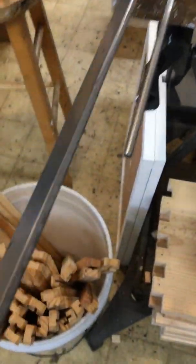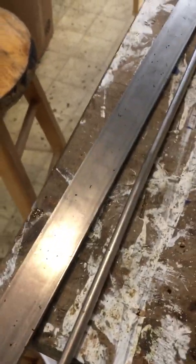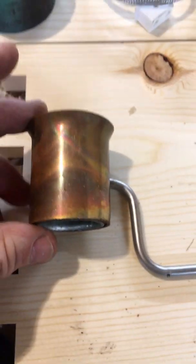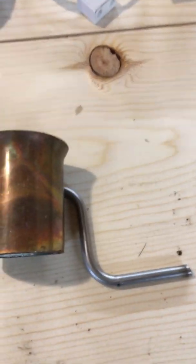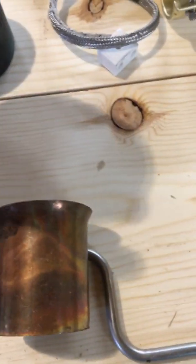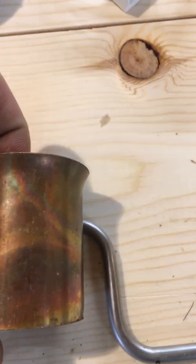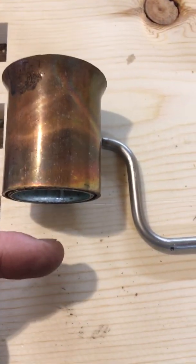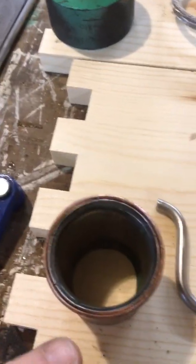To put one of these together yourself: stock steel, 3/16-inch, about a foot or so. Quarter-inch stainless steel tubing — you need a pipe bender to make the bend. When you make your tube coming out of the cap, you go for the distance because you have to set your distances for your cap when it goes down, so it's deep enough into the cup past the ridge but the tube doesn't hit the bottom. It's down about seven-eighths of an inch, and when assembled it sits pretty close to level with the base.